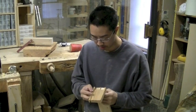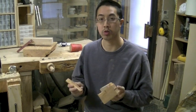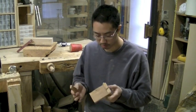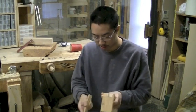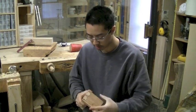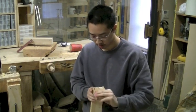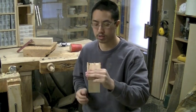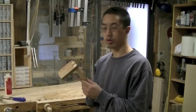So unfortunately, my pin board split when I put it together. Usually I use longer stock. This was just a little sample I whipped up for this video. The stock might have been flawed as well with a crack in it, I don't know. But normally, if you imagine those 2 pieces together, you'd have them together like this. You've got your 2 tails now formed, and if I pull on that joint, that's a solid joint there. And yeah, this is not a perfect aesthetic joint, but a bit of sanding and some sawdust and glue in it will look just sharp.